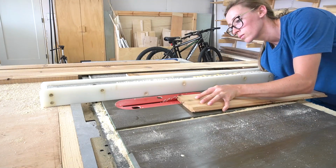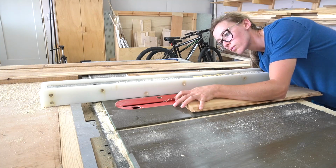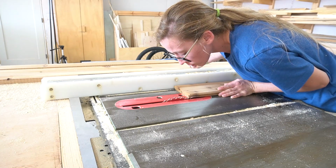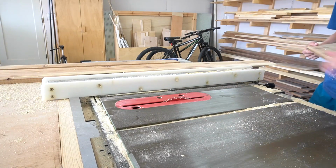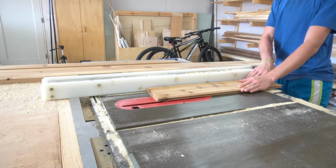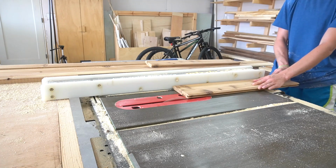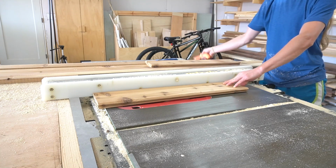I set the door aside for now and installed the roof slats. These are optional. I thought that they looked cute and added slightly more protection, but I really wish that I hadn't turned the tongue and groove cedar horizontally. I had already cut the pieces before I realized that I probably shouldn't have done it this way, and it's fine as is. It's mostly just for decoration, but it might have provided better protection if I had turned it the other way. This stuff was pricey though, and since I had already cut it, I left it, but I would recommend running them vertically instead.